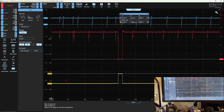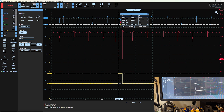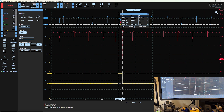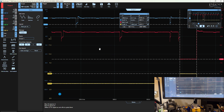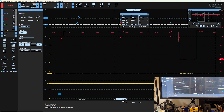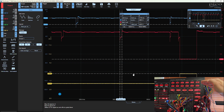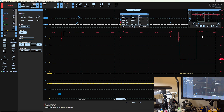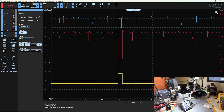This is indeed the complete control of that injector. At that time, if we measure this one, it was on for 24.9 milliseconds — that's long. What we're looking for, if we move over here, we can see the difference in on-time. We get like 3.1, or closer to 2.8 milliseconds. But yeah, this is definitely a software problem. I don't think we have any issues with the actual drivers because everything checks out there.